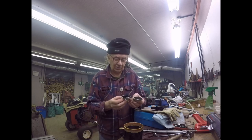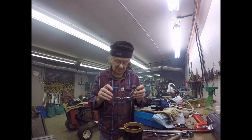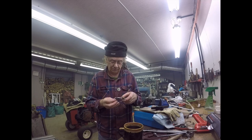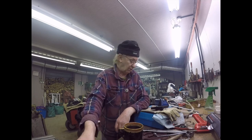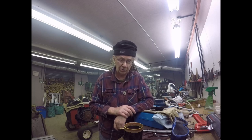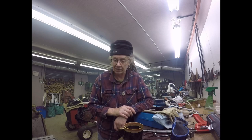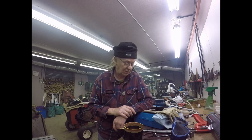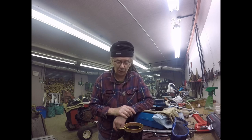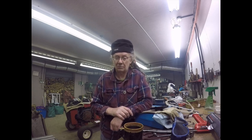I thought I'd show you my superb 1950s brazing lenses — they're really nice and give a beautiful clear view. I've also got some of these of course, but they need new elastic. The brazing hearth goes like a train and gets really hot, but not hot enough without some fire bricks behind it to get the workpiece up to temperature. I'm going to have a dig around for extra fire bricks — I've got some hard fire bricks outside — and then set it up again and have another go. If I can't get it to braze, I'll weld it. But we've advanced the tech level: I've now got the brazing half working, and I can heat up pieces of steel to bend them instead of bending everything cold.